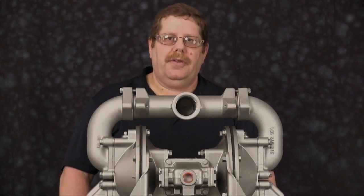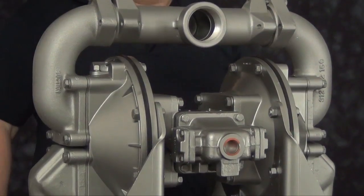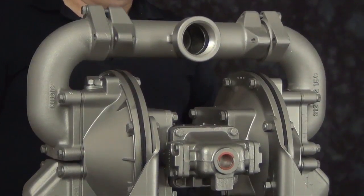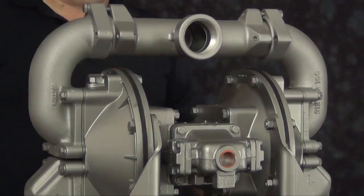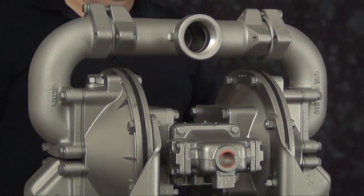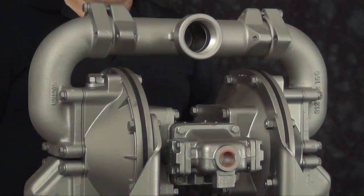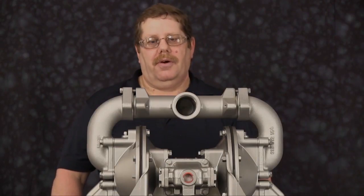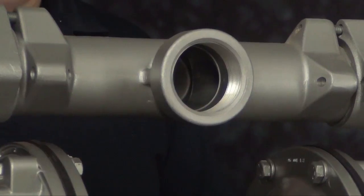This concludes the air end kit rebuild of the HDF2. The items we replaced are items such as the main air sleeve and spool, the bumpers, gaskets. We also installed plunger pins, plunger bushings, new U-cup seals, and inspected all the internal components to make sure everything was in very good condition. While the pumps are different in size and flow, the techniques used between the HDF2 and the HDF1 are very similar: torquing of the diaphragms and setting of the flap valves.